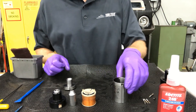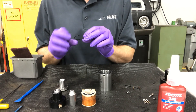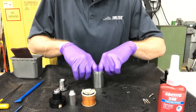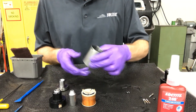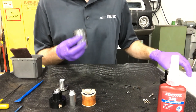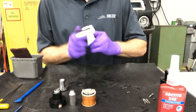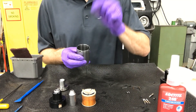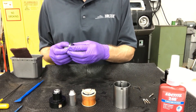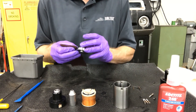After that, you've got the bottom piece and the body itself. This o-ring is a stack-up o-ring — it's not a sealing o-ring — so you just want to visibly inspect it for any damage. If you don't see any damage, you don't have to replace it, and it fits right down in there like so. This piece can be cleaned with alcohol, scotch-brite if you see any damage on the face, and then a clean paper towel. I'll pull the o-ring back out, get in there to make sure there's no debris or grease — looks pretty clean. The o-ring goes back in and sits on that shelf.